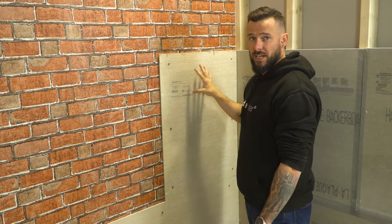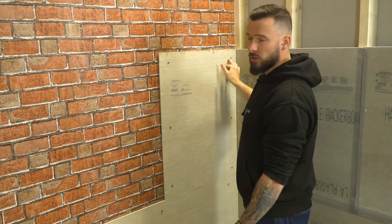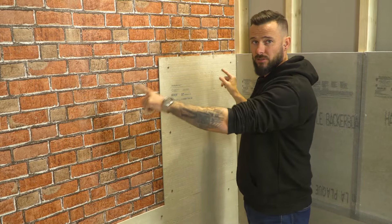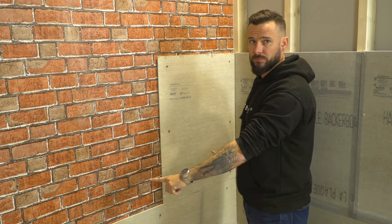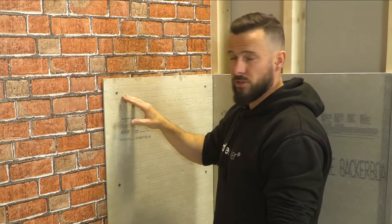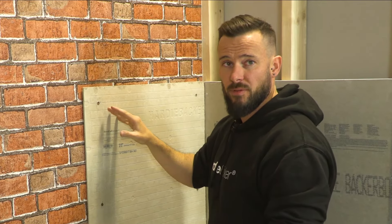In order to feather the wall, and then again you must just drill, plug and screw. Remember, on a full board we ask for a bank of three repeated three times. If this wall was skim, it's just the same principle — ensure that you're going through the skim into the masonry a minimum of 50mm.